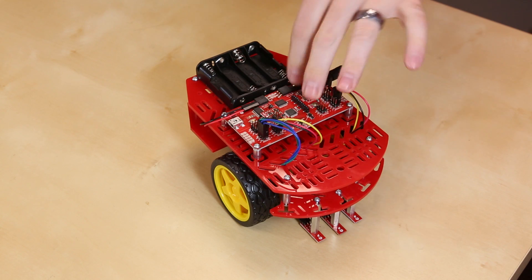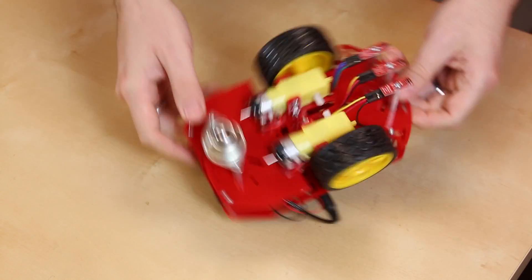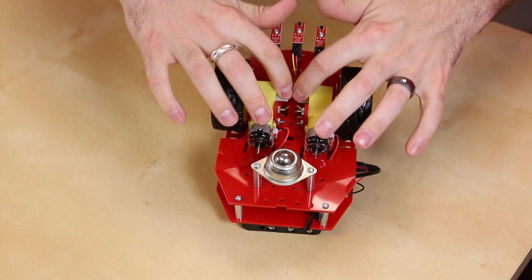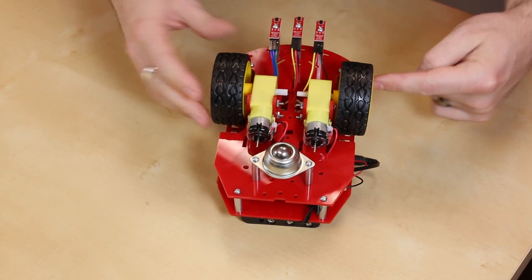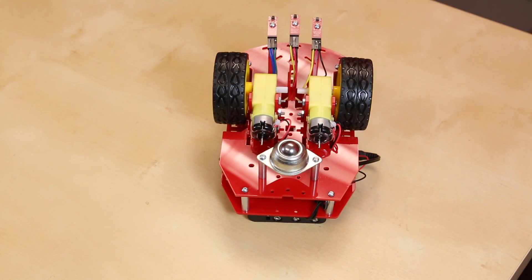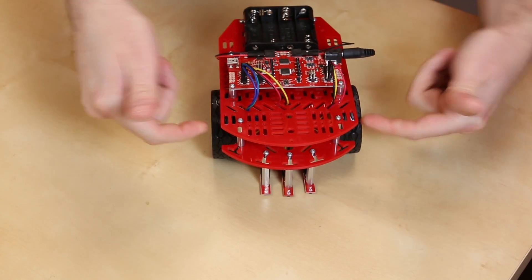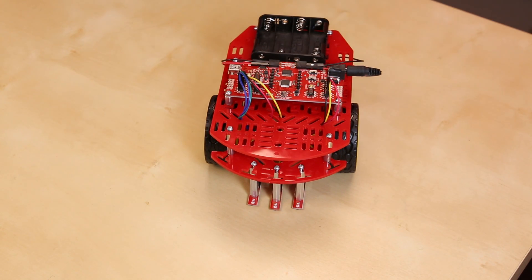There are a couple of minor tweaks to the mainboard, but this includes the newest mainboard. If we look at the bottom, there is one big improvement: we're not using the wheel encoder discs anymore — we actually have the dual output shafts. We have the output shaft that goes to the wheels and another output shaft on the back that works with the Dagu wheel encoders, which slap right on the back of the output shafts. No longer do you have to deal with little wheel discs; you just attach to the back of the shafts and run it directly to the board, making wheel encoding go a lot smoother.